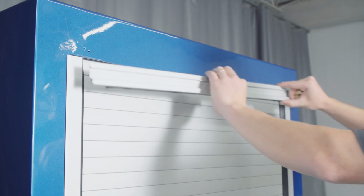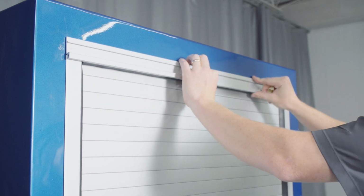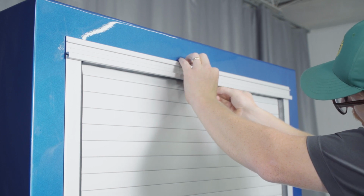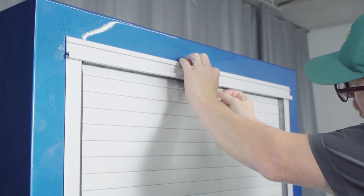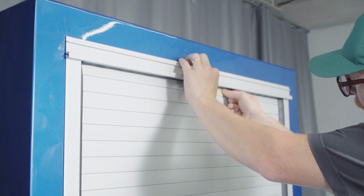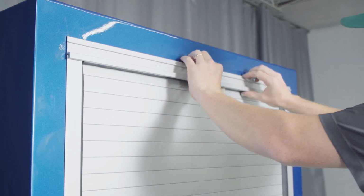Fully close the door and, temporarily holding the drip rail and top seal in place, use a light pencil mark or a temporary piece of tape to locate the rubber seal on the curtain so that it intercepts at least one of the fingers of the extruded portion of the top seal when the door is closed.